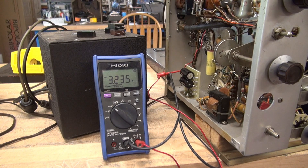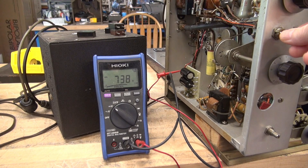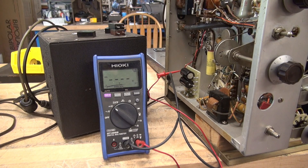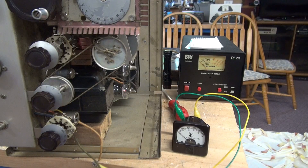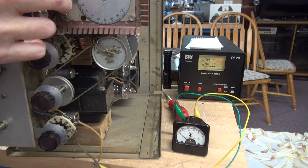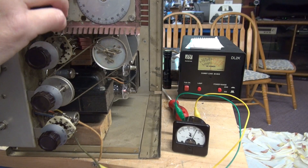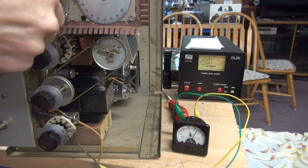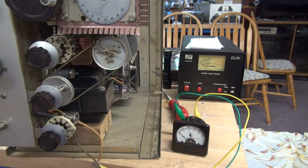I've hooked up my meter to the high voltage cap assembly. I'm going to turn on the plate voltage and see what we get — make sure our high voltage isn't low. We've got about 735 volts, and that's fine. So we either have a drive problem or possibly an issue with the clamper circuit. I just checked and the clamper pot was full clockwise, so I returned it back close to its minimum position. Now I've got full power out and a good plate dip. It was misadjustment of the clamper tube — I've got full output.